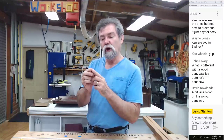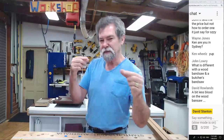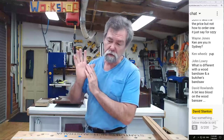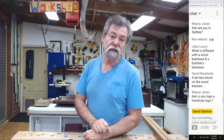So you advance it to the front and also make sure that the belt is covering all of the Vs and not off to one side, because it's easy to get them misaligned. So I make comment about that in the video as well. And then you tighten up this little jockey wheel and it pushes this little pulley. Well, it's basically a flat wheel that's wide enough for the belt, and it creates tension and makes it all work. So there you go.